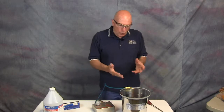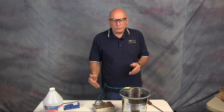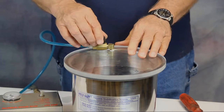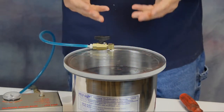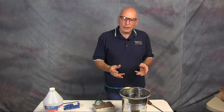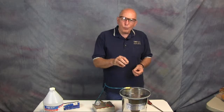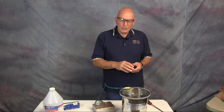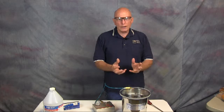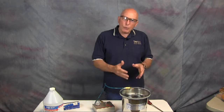Now, how do you know when it's done? Well, once you've held full vacuum on it, and I'll turn the vacuum back on and open our valve back up, when I see that the air bubbles have all but completely subsided, there's just no more air coming up, maybe a bubble once every few seconds, that tells me that now we're done. We've pulled all the air out, the air has pulled the resin into the wood, and that wood is now complete.